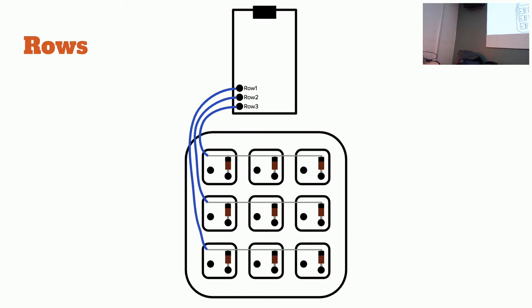Some more progress. Now start getting your row wires. Pins, right? Okay, so you're going to bridge all of those. The insulation on the Ethernet wire is thin enough that you could just solder right onto it. It'll melt and move out of the way. You might need to increase the temperature if it's not melting right through,